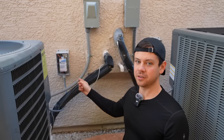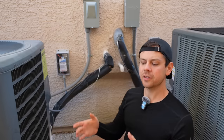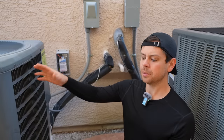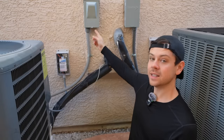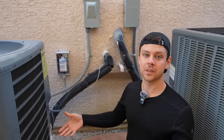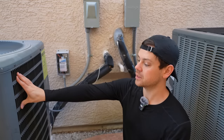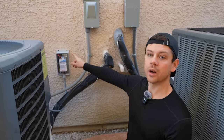When would you not want to buy a soft starter? First, if you have a grid-tie system only with no battery backup, I would not install one. Also, if you have an off-grid system running a critical loads panel and the air conditioner is not on that panel, I would not install a soft start. And if you live in a small house and have replaced your air conditioner with mini-split heat pumps — like I've done in my house — you don't need one either. I've installed about eight heat pumps so I can run everything off solar, and those slowly ramp up with their inverter circuit, so no soft starter needed. It only applies to large traditional split systems.